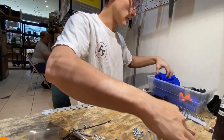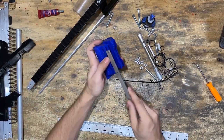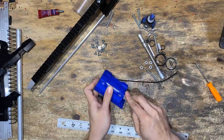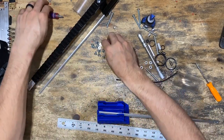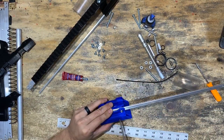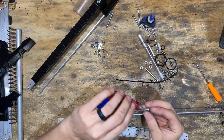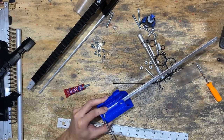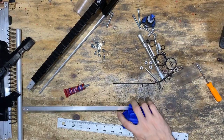Then I'll do the shuttle for the pump grip with a bar and two 10-32 hex nuts. I'll drop some thread lock on a 5/16ths screw and put that in, then more thread lock on another 5/16ths. Flip it over and do the other side.